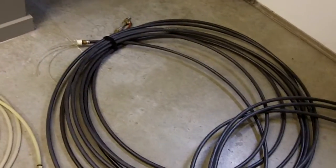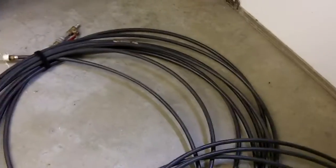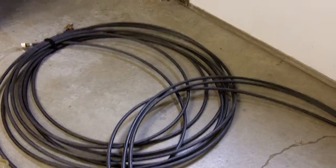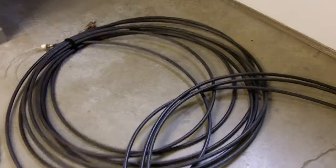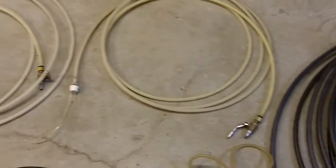The one in front here is 25 feet long. The one behind it is a 35 footer and a 25 footer coupled together, with the coupling right there, for when we use the drops on this. We have a building that's 8 stories that we do the dryer vent shafts on. These are rigid, they push down really well, yet there are some offsets in that duct system, and these will still allow it to go around them better than a rigid pipe system, which I'll show you in a bit.